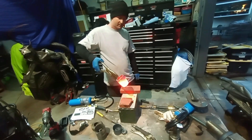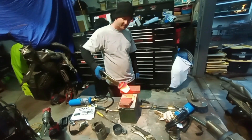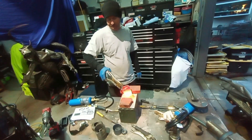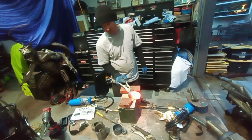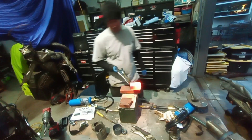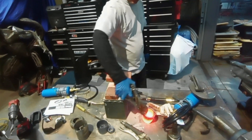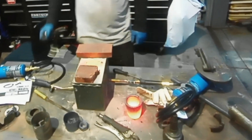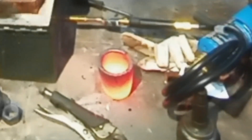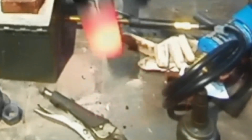The ammo can itself as a foundry is going to work just fine. The inside will eventually degrade and I'll have to redo it with new brick and quick-set grout — that's just the nature of it, even if you buy one from Amazon. For this build, at least I now know what to do and what not to do. The smaller bottles just don't really get all that hot — maybe enough to melt aluminum, so if you're doing aluminum you could probably go with this setup.